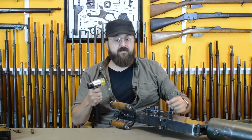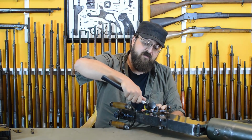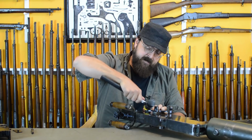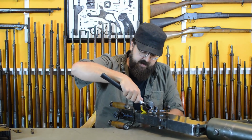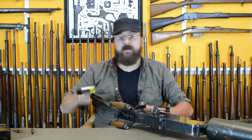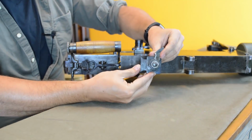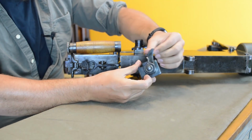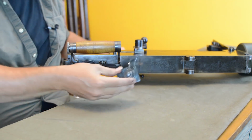Now, you don't have to use a rubber mallet for this. If it is even a little stuck, you can just take the bolt arm and work it back and forth, but that's gonna be a lot of metal clanging, so I'm just gonna do rubber on metal. Again, not necessary, just a little easier. So, what did that get me? That got me our rebound preventer and our roller block that's designed to sort of let this arm bounce off of it. This is the cool part.